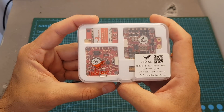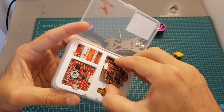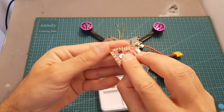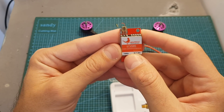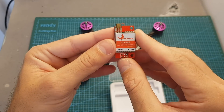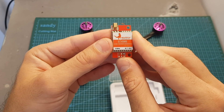The Batman 220 is using the Titan Plus F460 stack. On the bottom of the stack we can find a 60-ampere 32-bit 4-in-1 ESC, then in the middle an F4 flight controller, and on the top the GTX 585 VTX. It has a selectable output strength of 25, 100, 200, 400, and 600 mW, and it also supports smart audio. I actually tested this VTX separately and it performed quite well.